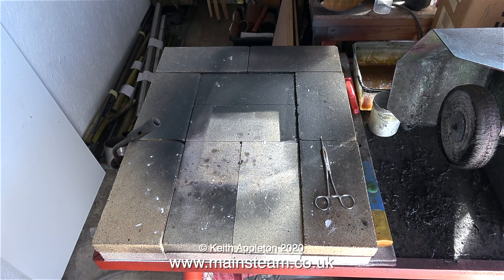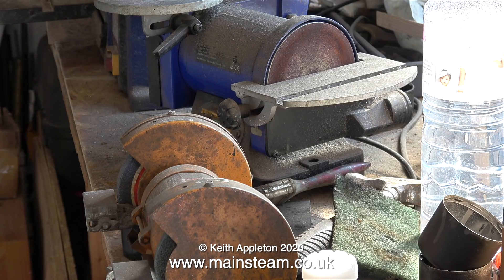I'm now looking at what I term the outer part of the workshop. This is where I do the silver soldering, grinding, and polishing, and it's right next to a door that I can leave open to make sure it's well ventilated. The brazing hearth that I use is nothing more than a substantial steel-frame table with a wooden top covered in vermiculite blocks — it's a very simple thing and it works really well. Behind the brazing hearth on the bench is a small bench grinder and a pair of belt sanders, a one-inch and a four-inch.